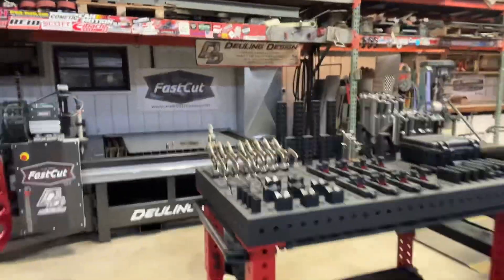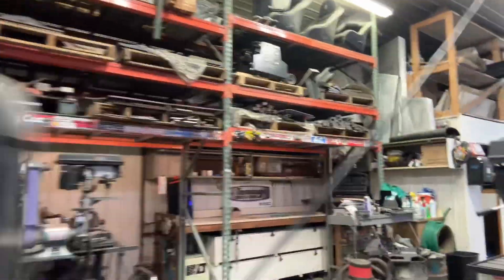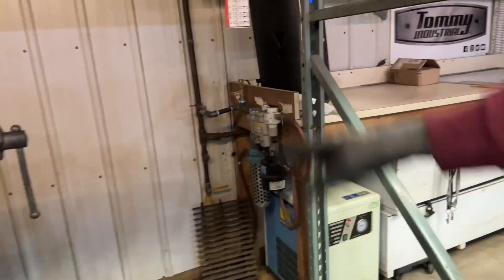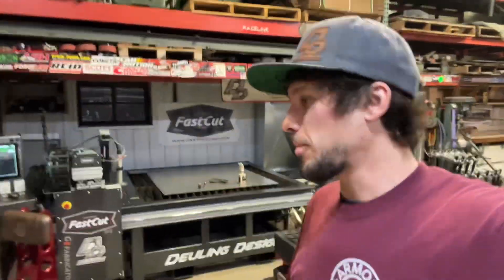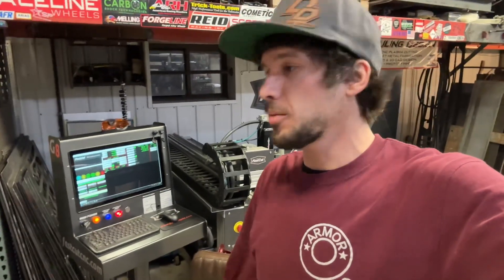I have pretty good air — I have a nice little air dryer set up over here, dry filters, regulators, all this stuff — but I just wasn't getting that cut quality or that consumable life that I was hoping for. So that made one of the biggest differences on my plasma cutting: I spray the plate with it, and I spray the consumables — the nozzles. Hope it works for you.